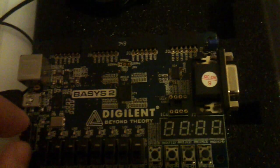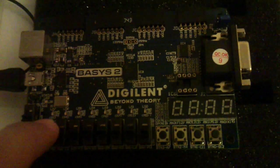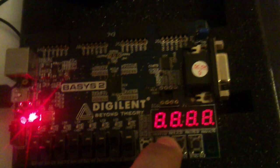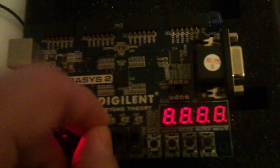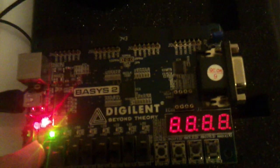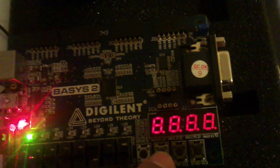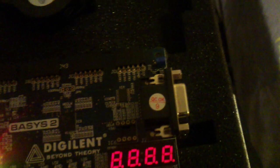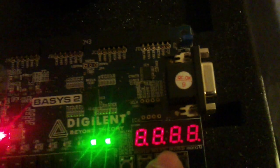Let me show you the full flag. This is the LED that should turn on when the FIFO goes full. So let's take it to its maximum capacity — I'm just going to write data here constantly, just give it some random input. There we go — the FIFO is full and the LED has been turned on. Now, no matter what I do, data will not be written — it will not take any input because the full flag is on and it does not have any more capacity. As soon as all of this is read from the FIFO — read, read, read, read, read, read, read, read, read — it's empty again and now data can be written into it again.